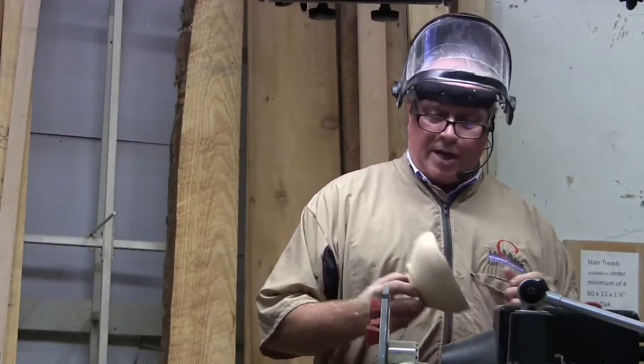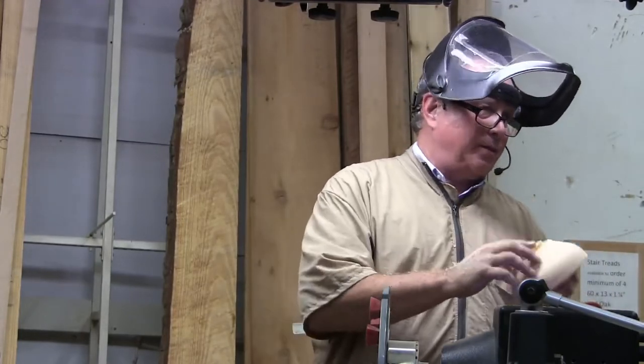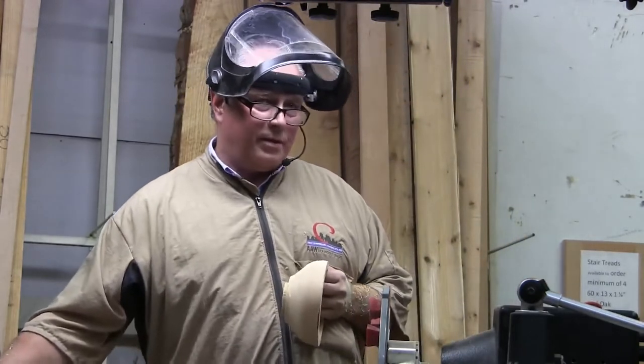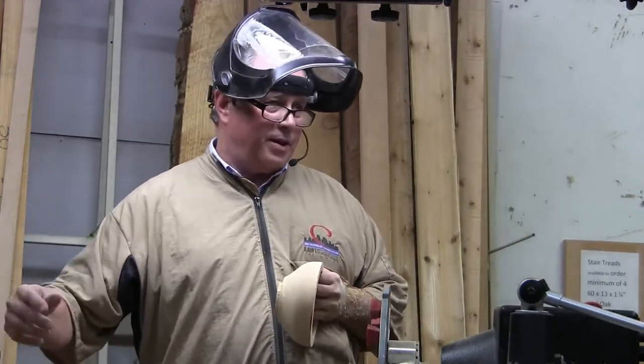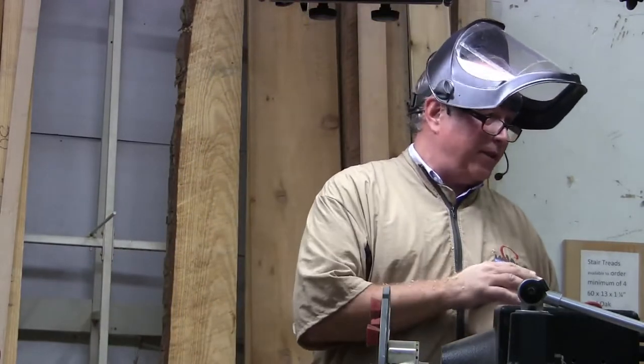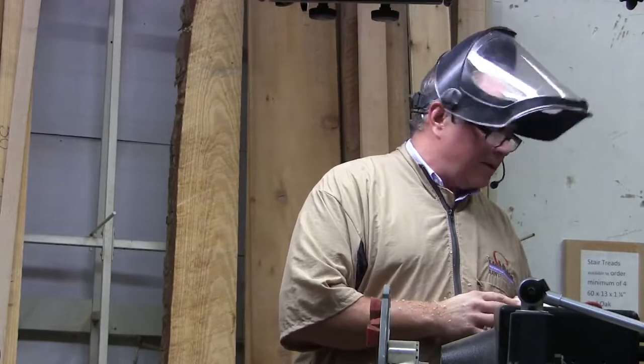So the jam chuck, as I found out, was a chunk of wood with a pad on it that you push against with your tailstock, which when I had my first center was not really a live center. I had to put oil on it. So you didn't have a bottom on your bowl. You had felt, and that covered up the oil.